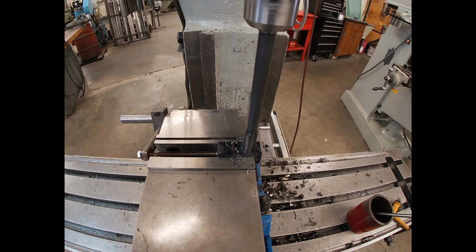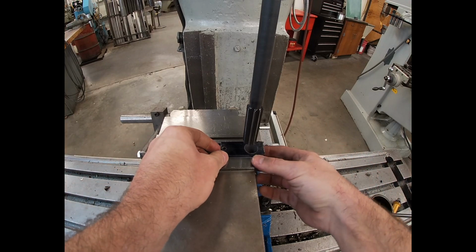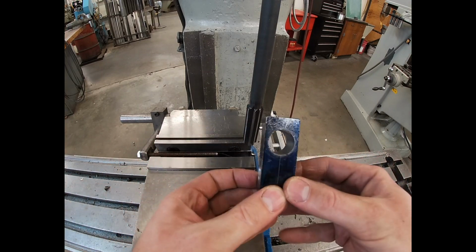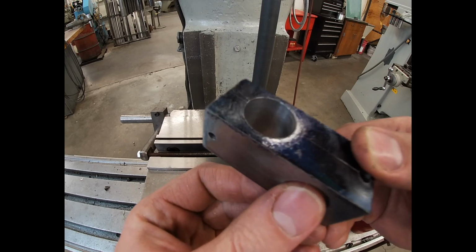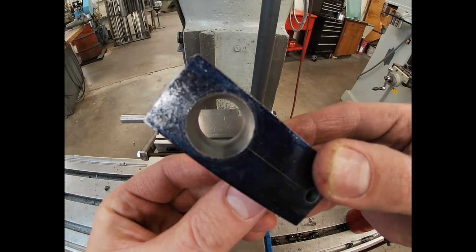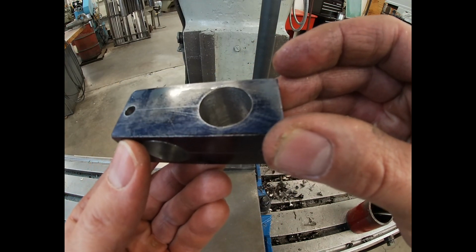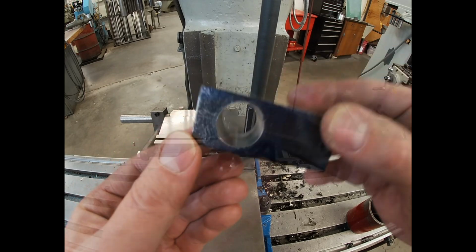That's very consistent on the feed rate, watching the spindle go down. So actually it might have been by hand. And then if you are power feeding, you can power feed back out, and then if your reamer has a dull spot, you won't have the swirly marks, but that hole's pretty clean, so I got away with just dragging it out.